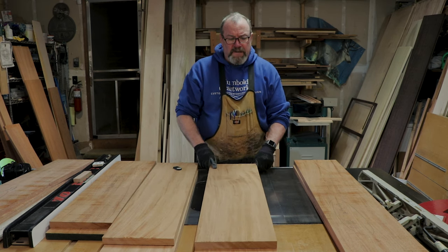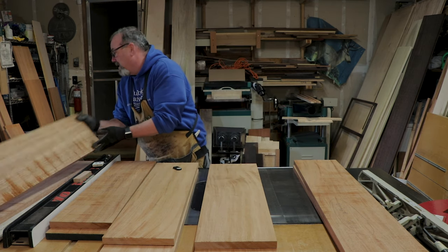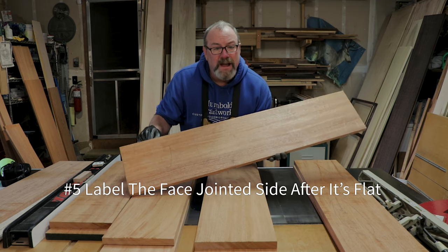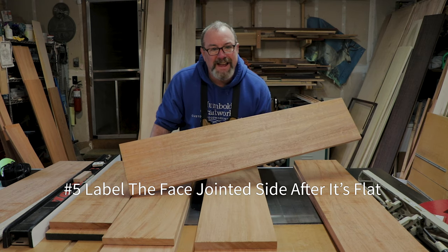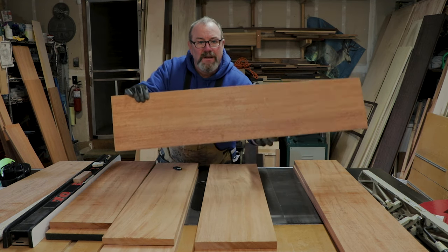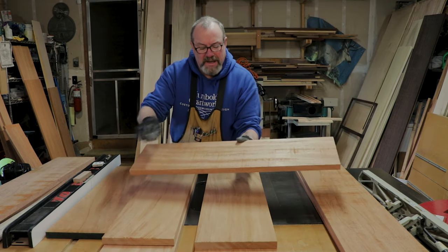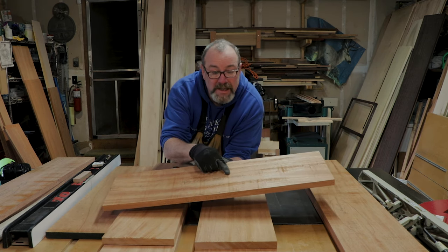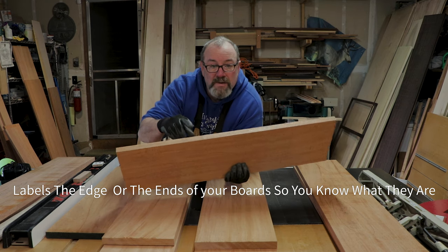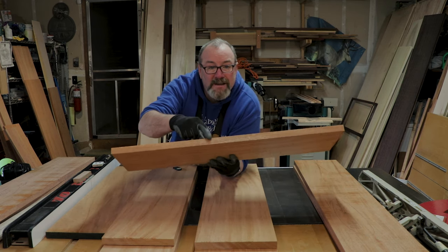So I'm going to face joint all of these — they're all wide and long. What I do is face joint them first to make sure I get them flat, and some of these I've already done. After you're done face joining them, make sure you mark them so you know you've face joined that edge. That way you know you're done. So mark your material once you're done face joining and your surface is flat. Also, make sure you write identifying information on the edge of the board — what the door is, where it goes, how wide it is, how long it's supposed to be — because you'll probably face joint or plane off anything written on the face.